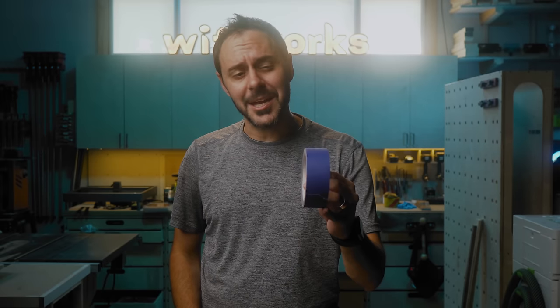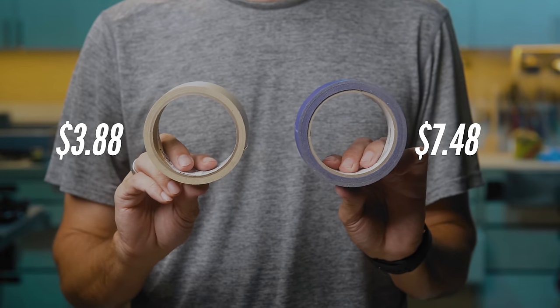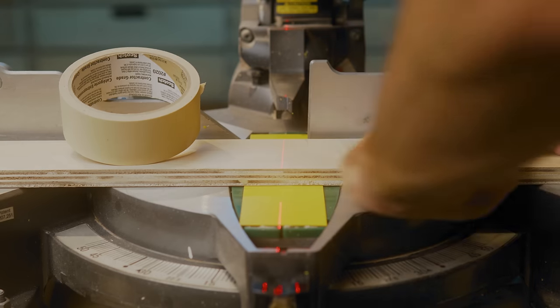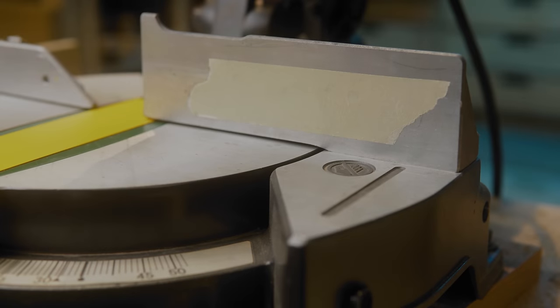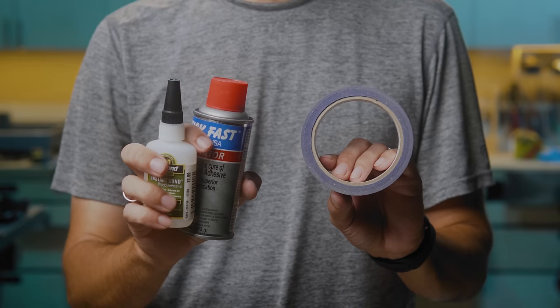Here's a tip on the blue painter's tape trick — I'm going to break from consensus here. Instead of paying seven, eight, sometimes nine dollars for blue painter's tape, I go for the cheap beige masking tape which is usually two or three dollars. I found that it works stronger, doesn't leave any residue, and is about a third of the cost. The process is simple: put a piece of tape on your fence, put a piece of tape on the back of your plywood, apply some CA glue to one side, spray activator on the other, and within seconds of contact you have a bond. But if you want to do a little better, skip this completely and get a high quality double-sided tape made for woodworking — it's stronger, thinner, faster, and cleaner than the blue tape superglue method.